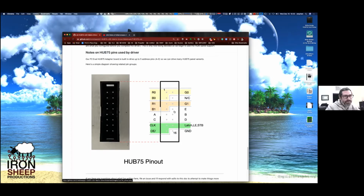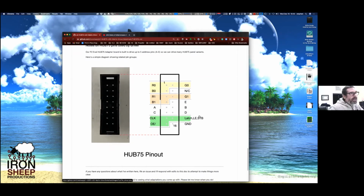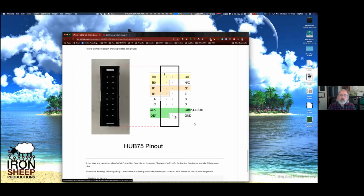Stephen, so you know what? Some sense of future, you could probably do a smart pin to generate that strange signal with that inconvenient timing. Okay. Right? There's a few ways to do it, but there's one output mode where you select, I think, the overall cycle time, and you select the on time, and you can control polarity. Well, that's interesting because that says we could drive the latch pin and the 6 RGB pins directly from stream. Well, you're streaming unique data onto the RGB pins, but you have a timed signal that you have to put on that latch, right?